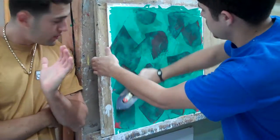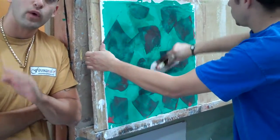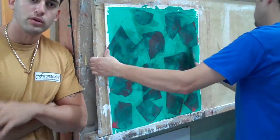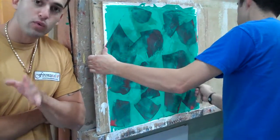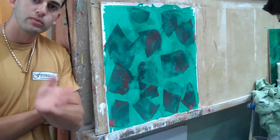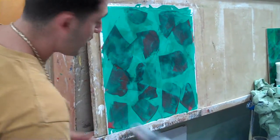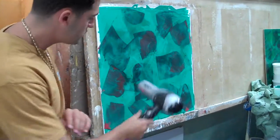On this angle where I'm looking at, it is very, very shiny already. Remember, with third coat application, you want to burnish it right away. You don't want to wait too long to burnish it. So basically burnish it while still wet. So in a real wall, 2 to 3 feet at a time, stop, burnish it, keep moving forward. Basically that's the way it looks. I'm going to dry it a little bit for you to see how it looks.